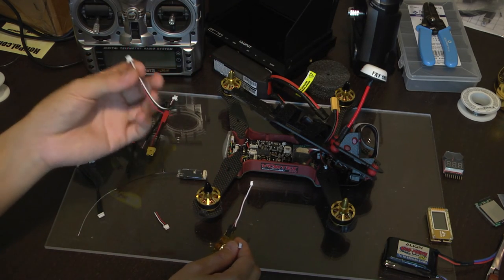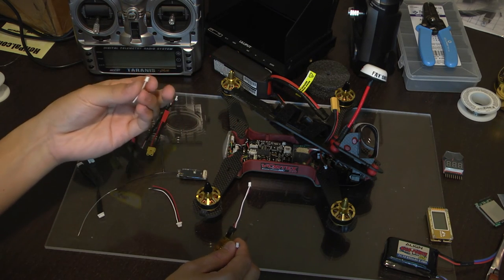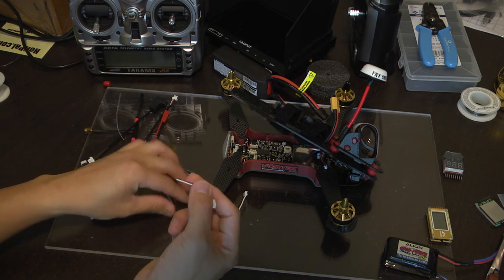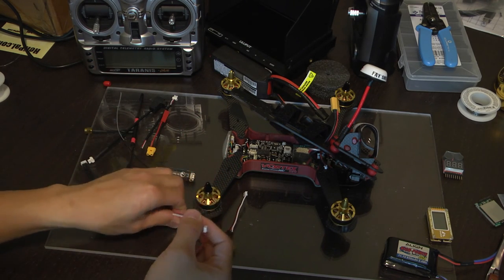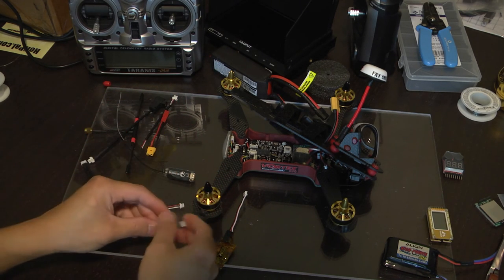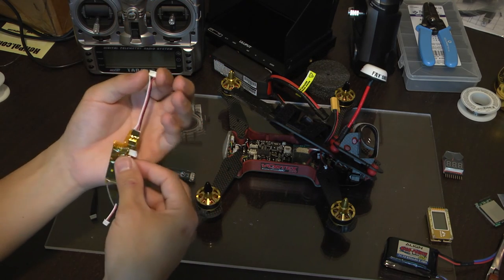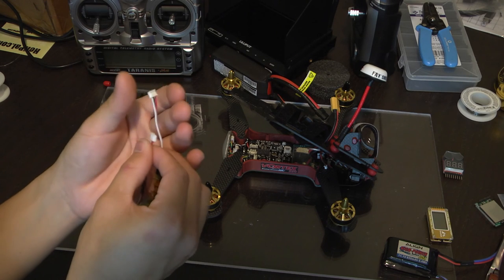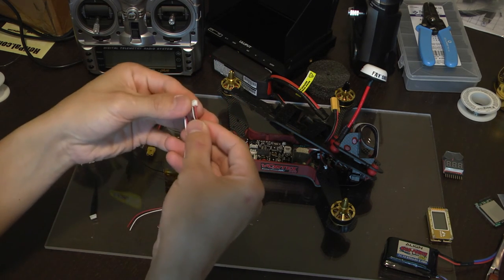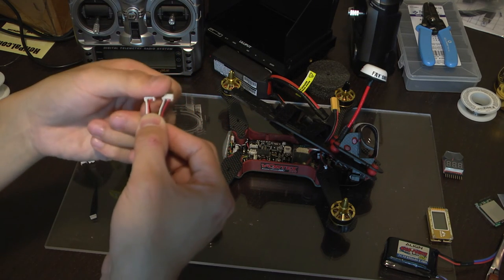I used a Spektrum cable that was included with the Vortex, and also the other cable, the mic receiver cable here. I simply just cut it, and then I took the pin 4 on here off of the Spektrum cable. The end result was this nice short S-bus cable, and for polarity reasons and orientation or color reasons, make sure that you have them in the right positions.